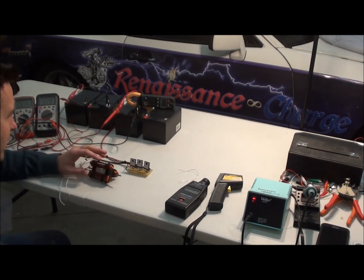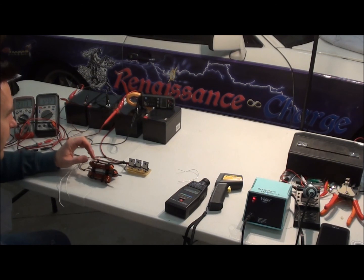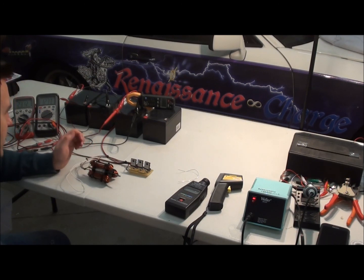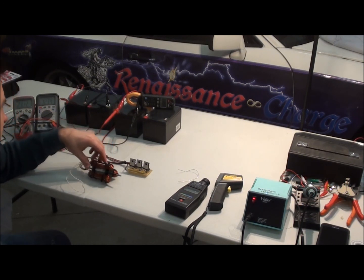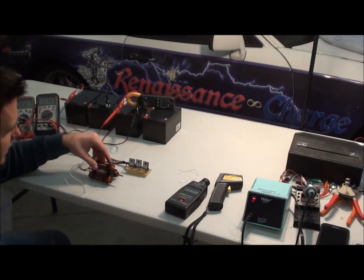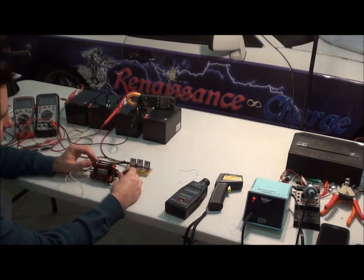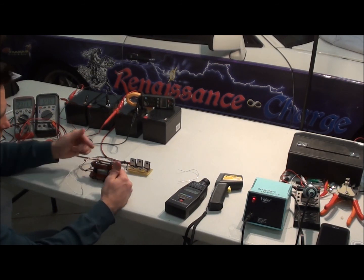Running one of these coils while you have all three coils mounted, you actually want to try and run them at the same time because they interact with each other somewhat. You can run one at a time but you'll have to change some resistor values, and the positioning will change a little when you take coils off. I ran them individually first to determine which wire was which so they wouldn't fight against each other. Once you apply power through the reed switch to the gates and transistors, the current flows in a spin motion. Depending on which wire you hook up, it will turn one way or the other — if you have it wrong, one will fight against the other and it won't run.